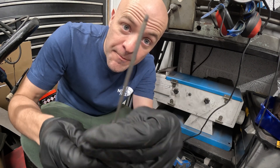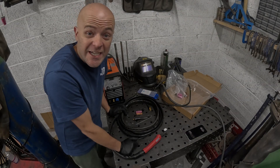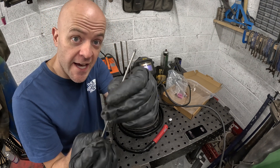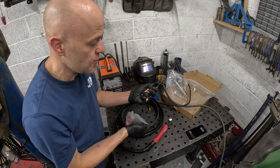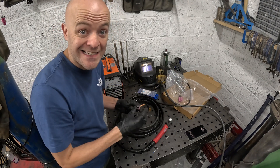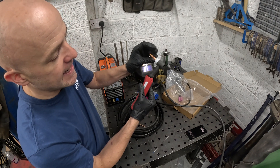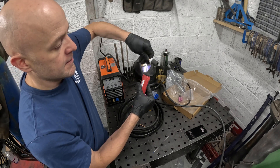It's going to be quicker to copy me than to learn Chinese and work out the instructions. You've got your 2.4mm tungsten already sanded to a small point, then a bag of fittings. I'm just using a gas lens with the number six on it. Get the torch and look for this piece — push it into that end and start screwing until it finds its thread. Give it a good hand tight and it's not going anywhere.